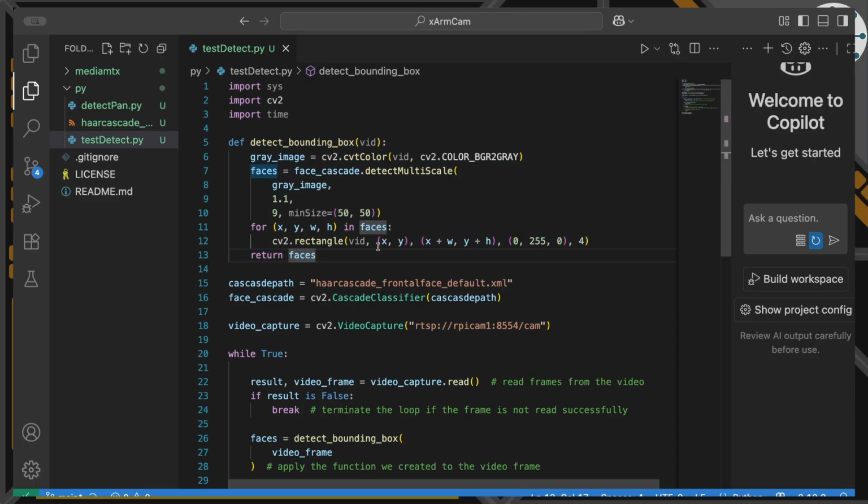And the first thing we do with facial detection is we drop it back to a grey image. So we don't need all of the extra data that's provided by color, so we're going to first of all grayscale it. So we're going to get this face detect to run therefore as an algorithm on our grayscaled image. We're going to give it a scale factor so it can scale things down a little bit of 1.1. I'm then going to look for minimum neighbors, and I've set that to 9. This is just trying to clean up where we're getting overlap of images and it's not over detecting. So you need to play around with that figure a little bit, but I found 9 was good for me. And then the minimum size of an image for a face, and I'm saying that's 50 by 50.